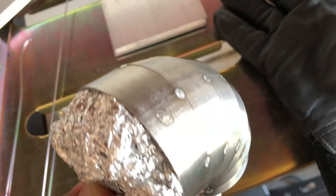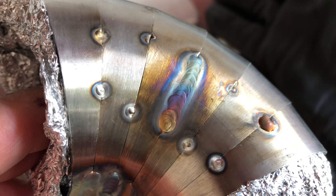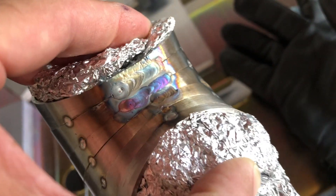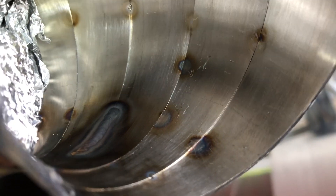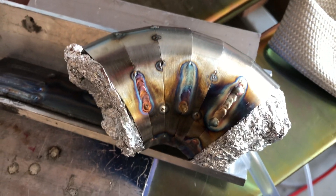There was a little mishap with not having a properly grounded part to the table, and that right there was my very first attempt at feeding the filler rod. I was trying to get a very consistent motion with it. I took one of the caps off and wanted to see if I was using enough amperage, if I was getting any penetration through the other side, and if everything was flowing as I wanted it to with the argon backing.